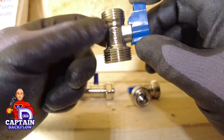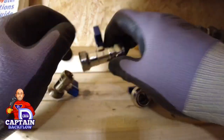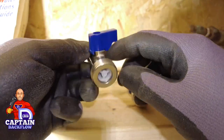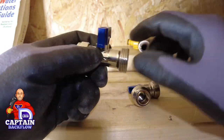So what do manufacturers do to help? Not a great deal. This standard washing machine isolation valve has no backflow protection built in. However, this one has a single check built in — so there's some protection — but I'm not a fan of single checks. I do prefer a double check valve on washing machines and dishwashers.